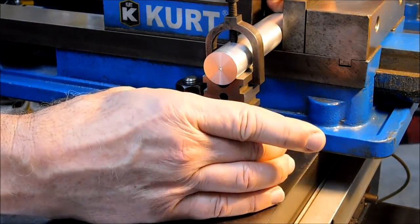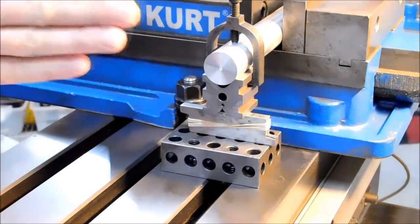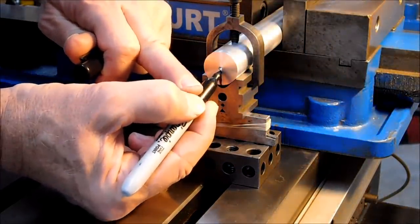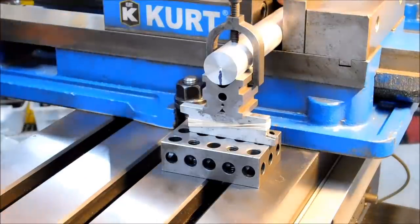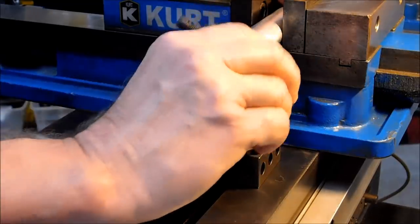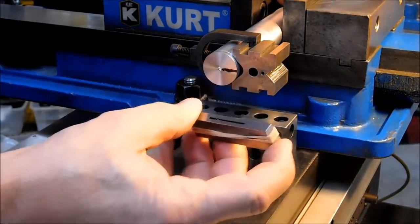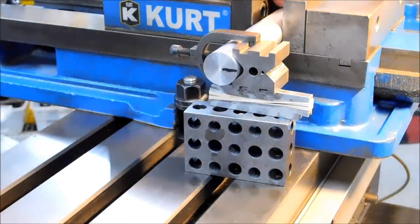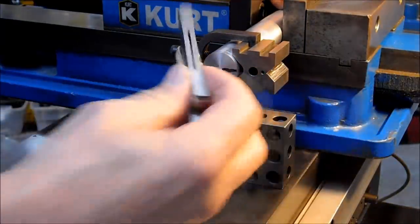Adjustable parallel with a rubber band. Watch it move — see it? This is tight, nice and tight. Now we have a good registration. You can do the exact same thing if you want to rotate this 90 degrees. Let's put a mark on that just so you know what's vertical. Be careful you maintain down pressure on this because that rubber band around that adjustable parallel is going to want to lift. Once you've got that all squared away and you want to go to horizontal, you have a surface you can indicate if you need to, or you can cheat with the adjustable parallels again. 90 degrees.